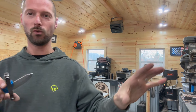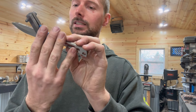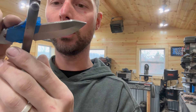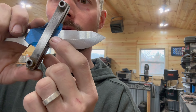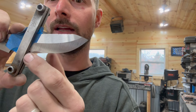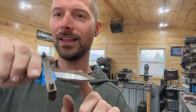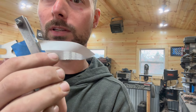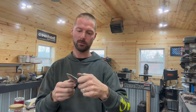I'm actually stopping in the middle of 120 to show you guys something. This side's a little worse than this side, but you can see where that plunge starts — it comes up and over and it almost swoops, it kind of comes down a little bit. A little bit of that is okay just because of the way the profile of this knife is, but I'm not completely happy with it. You can kind of see it gets a little swoopy, and I see that a lot with people doing freehand bevels.